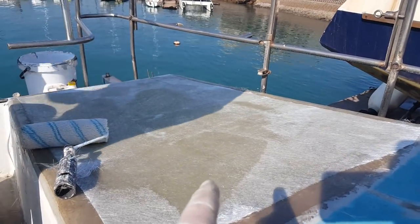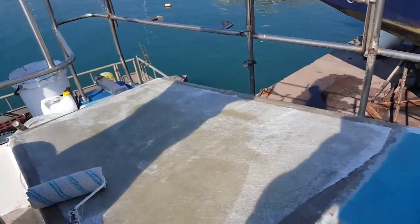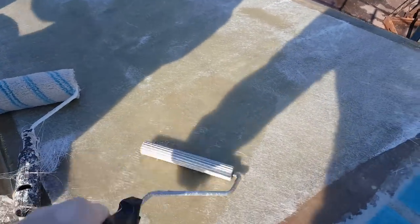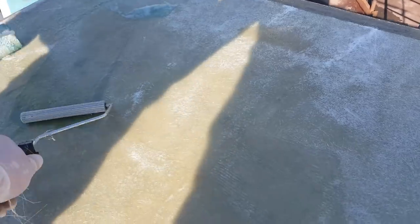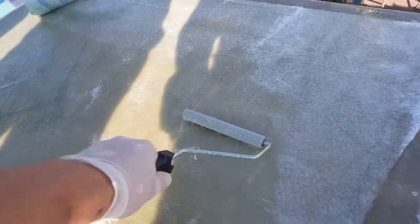Each layer needs to be rolled out so all the air comes through. That glass must become completely transparent — if it's not transparent yet, you've got to roll it with a steel roller until it is. Until you feel those air bubbles are completely out. You can hear the sound it's making — not too much resin in there. If it hits a spot with too much resin it sounds different. Once you start hearing it bubbling, you know the resin is right to the top.